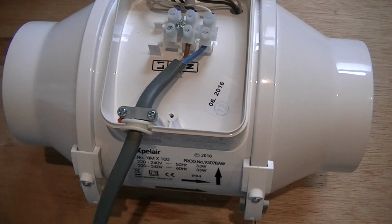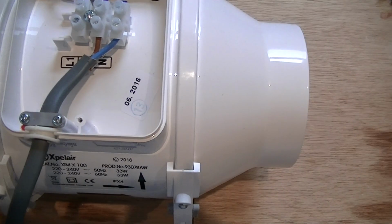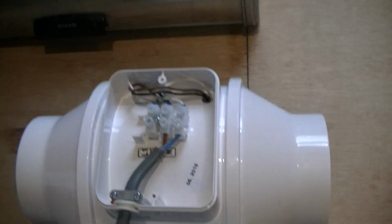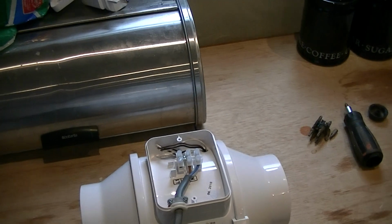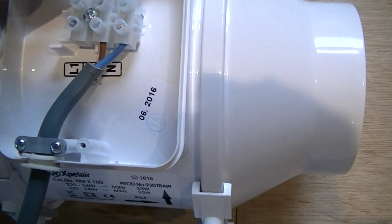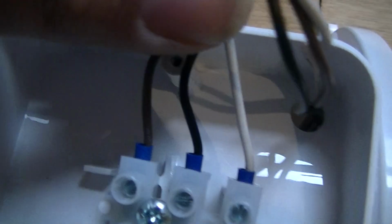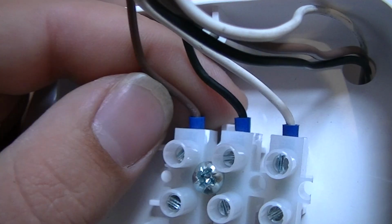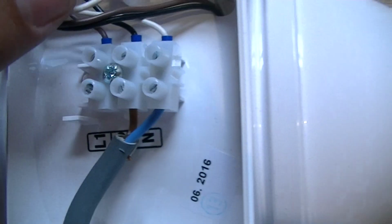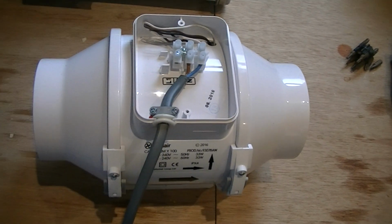Anyway, what I'll do is I wanted to check if I could switch between the two, and I think I would be able to. So it should not be too bad, because I want this connected up to my control panel and I can flick between high and low with a flick of the switch. That'll be that easy, but I'll see what it'll be like. So if yours has not got any labels on the connections, the brown is speed 1, black is speed 2, and white is negative or neutral. So I'll run it on 2 different speeds just to show you what it's like.